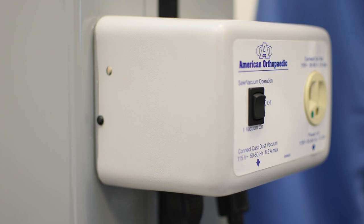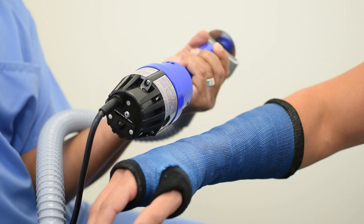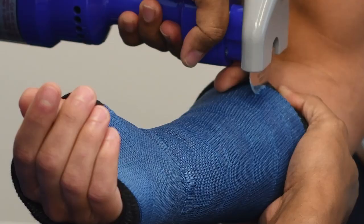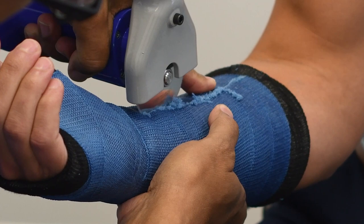Place the toggle back into the off position. Then, plug the saw power cord into the relay box. Toggle the switch to vacuum and saw use. Turning on the saw by the switch on the bottom of the saw will power up the device, operating both together. To allow for better leverage, start further away from you and start cutting toward yourself using an overlapping method — meaning use half of what you just cut into to further advance the saw.